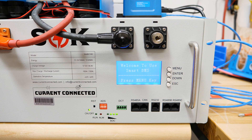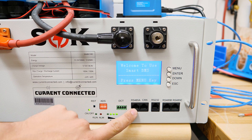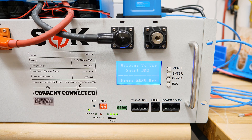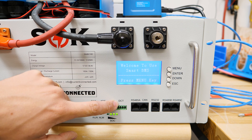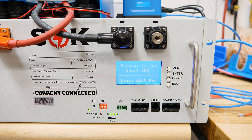Next I want to cover the communications, because it's not all that important for a lot of applications. Communications are only important if you're using one of the inverters that support it. That includes the RS485A and CAN ports — these are your uplinks to your inverters — but also the RS485B and CAN. There is no point in plugging in the RS485B and CAN ports to the other packs unless you're using the PC uplink with RS232 or inverter uplink with CAN or RS485A. Additionally, there is a port labeled DCT — this is a future feature, essentially a dry contact so the BMS can turn stuff on and off, but it's not currently in use, so go ahead and ignore that.